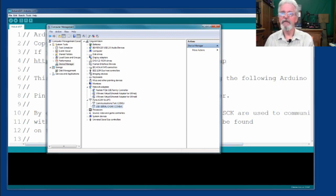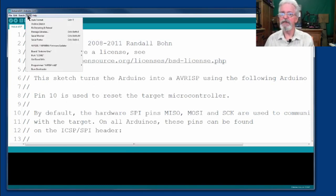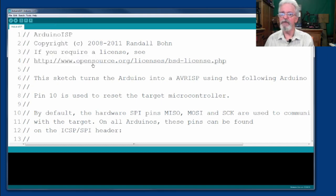It's kind of funny we're having to do this because I just had this plugged into another port and had the driver. What happened was I had a power failure and my battery backup battery is dead. Looks like we got a new driver — we'll go ahead and load that. The driver for the board is now on COM14. Now let me close Device Manager. We're back to the Arduino IDE. The first thing we're going to do is go to Tools and select Arduino Uno, then go back to Tools and select the COM port — in this case it's COM port 14.